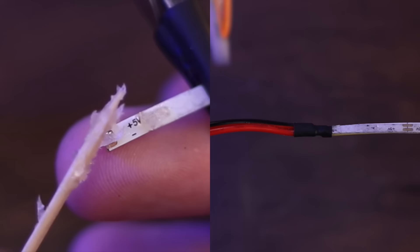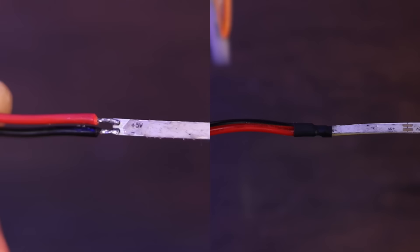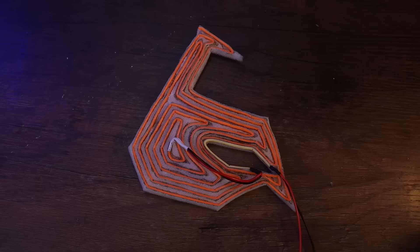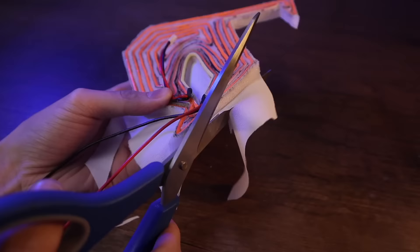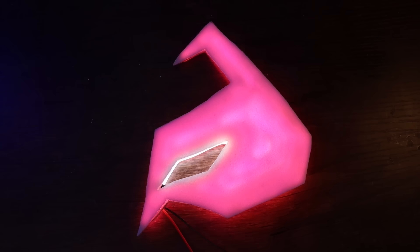Basically, I just add some solder to the copper pad, then add some solder to the wire, then melt those two together. Red goes to the positive, black goes to the negative, and when I'm done, I can cover it with some heat shrink tubing. This white LED strip fits snugly right into there, and I'll lock it in with a little bit of super glue. The light does not look very even — you can still see stripes coming through the upholstery foam — so I went ahead and added some thin white spandex over top of the upholstery foam to soften the light even further, and that helped a lot.